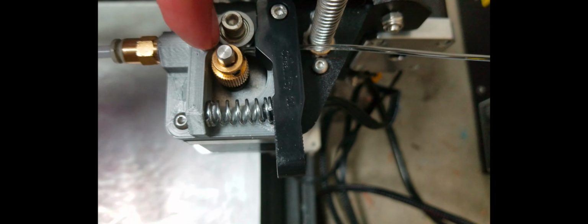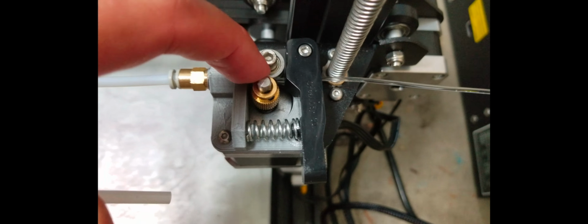So it essentially prevented slack when it pushed back into the stepper motors or into the pulleys. It prevented the slack from occurring. So I printed that, put in the tube, and away we went. On to the next print. We're going to watch the extruder and see if it bunches up here. So it'll take probably a couple passes for us to find out.